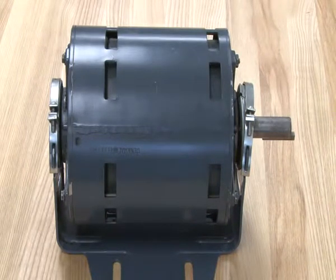This is week six discussing motors. The types of motors we're going to talk about today will be split phase motors, PSC motors with permanent split capacitors, and shaded pole. What you see here is a split phase motor.